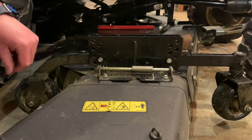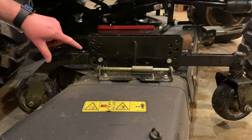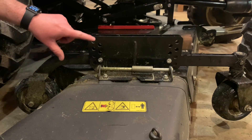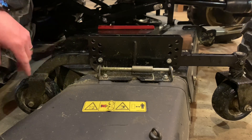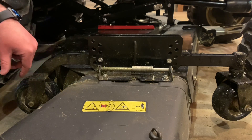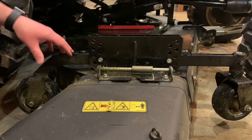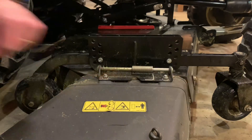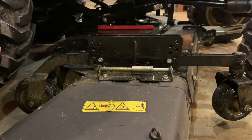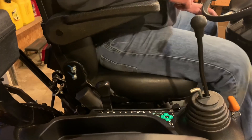The different holes are in half-inch increments, so this deck is designed to mow from one inch up to four inches, adjustable in half-inch steps. The way I have these wheels set up right now they'd be configured for three-and-a-half inches. However, I don't use the deck that way — I actually use the three-point. I set the stop on the three-point to keep these wheels just off the ground and use them more as anti-scalp wheels rather than carrying the full weight of the mower deck.